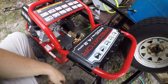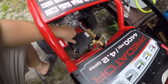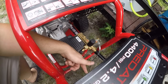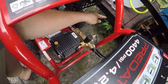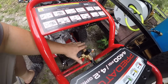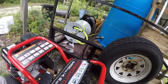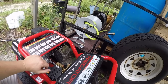If you bought one of these pressure washers — maybe not the Predator, maybe a cheaper model — the unloader valve is built into the pump and does not have an option to dump the water on the ground or back into your buffer tank to keep the pump cold. Water comes in and water goes out, that's it. When you let off the trigger, water just stays in the pump and gets hot. You'll burn the pump up if you let it run two or three minutes without pulling the trigger.